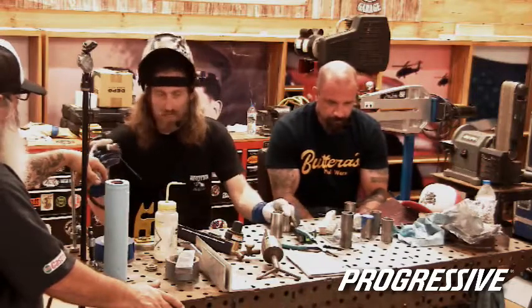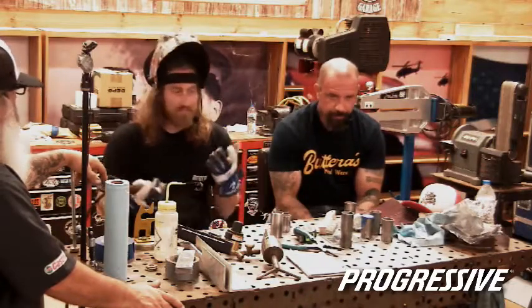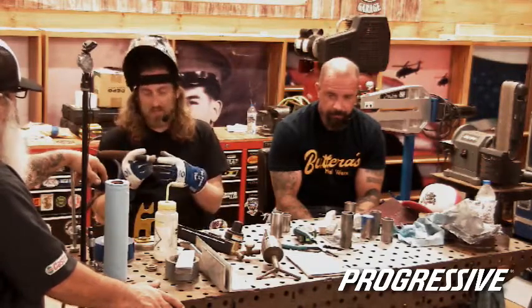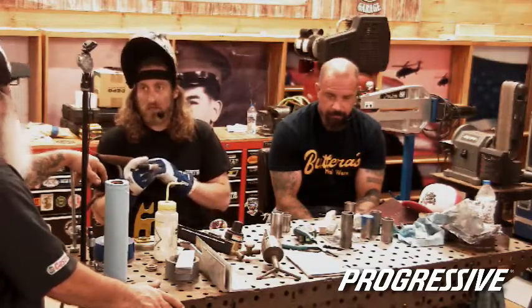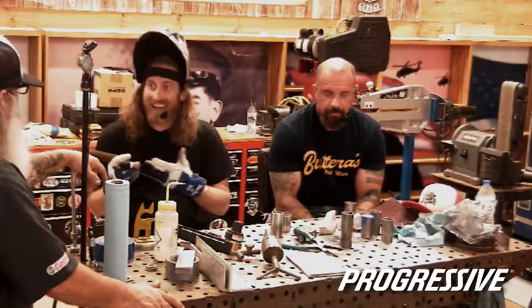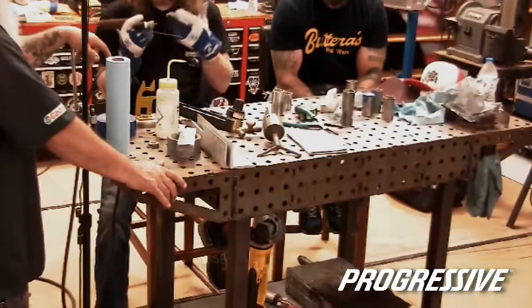Post flow, you don't have to get crazy with post flow. Eight, 10 seconds, depending how hot the weld is. You just don't want your tungsten to be orange when the argon turns off, because then you're gonna introduce oxygen into the hot tungsten and compromise it. And then it's little variables that you may not know is the problem, and it can screw you up.